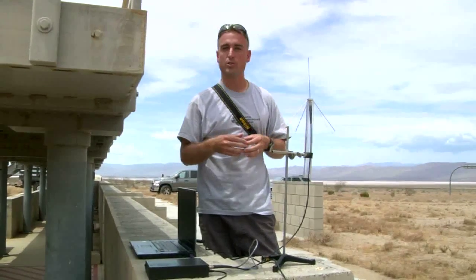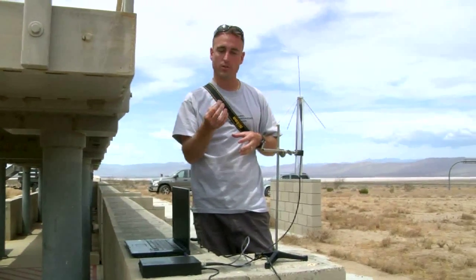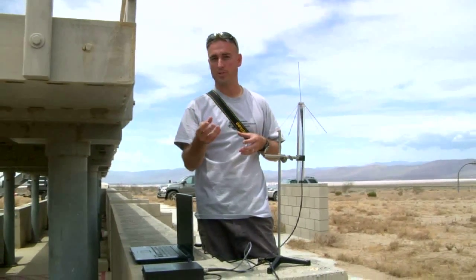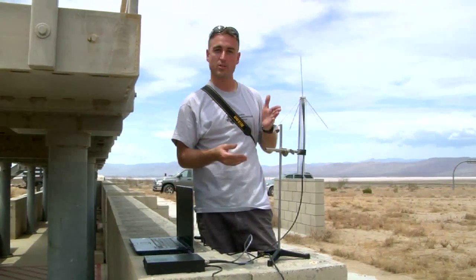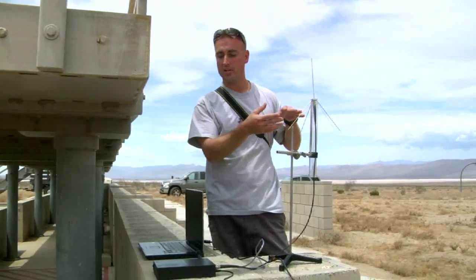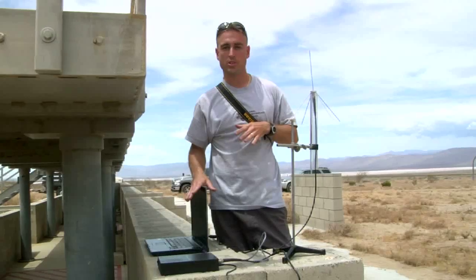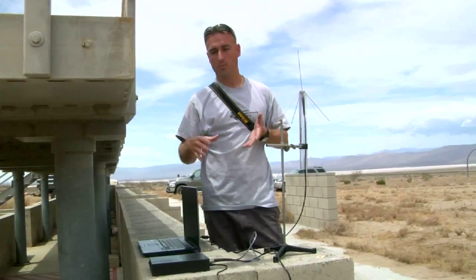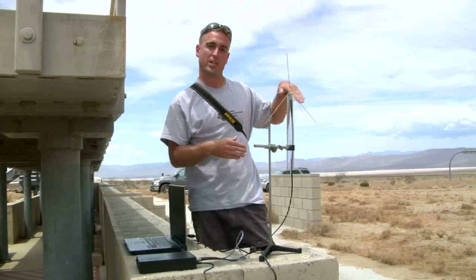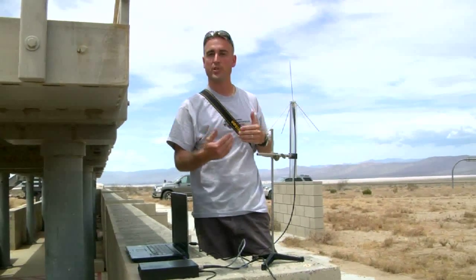We hooked up this little circuit card that has a thermistor on it. It sends back a tone based on the temperature, and as the temperature varies as the rocket goes up, the tone changes. It transmits real-time data back down, and once we get back to the school we'll download this information into software and plot the temperature variation as it varies with altitude.